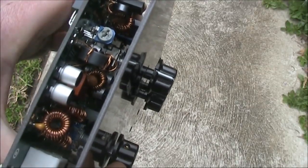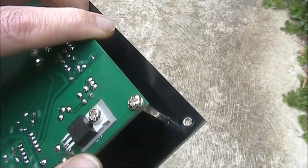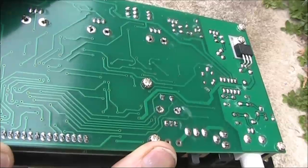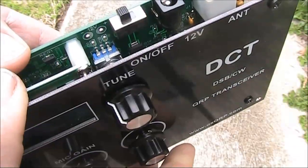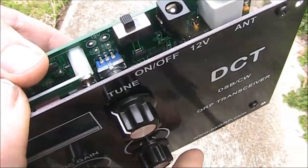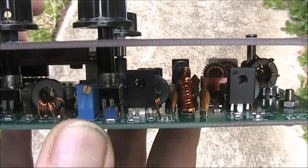All components are mounted on one side of the board, except for the final transistor, which is on the underside. What is immediately striking is there's not that many solder blobs — that's because a lot of the kit is surface mount components, which are already on the board when you get it. Your job then is only to mount the through-hole components.